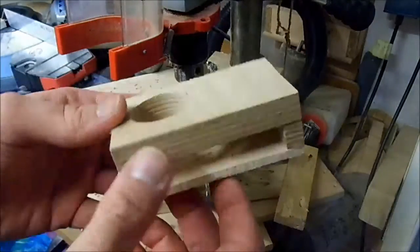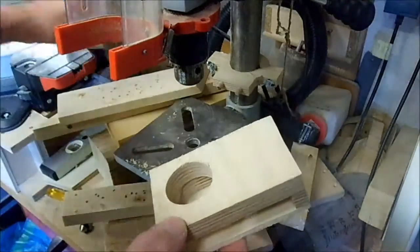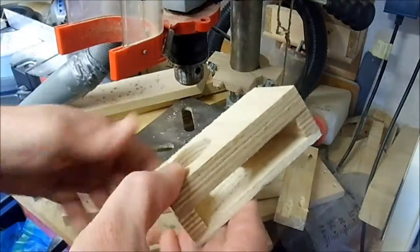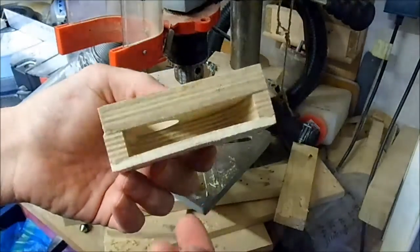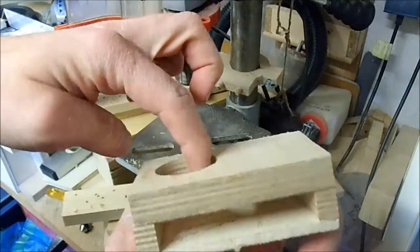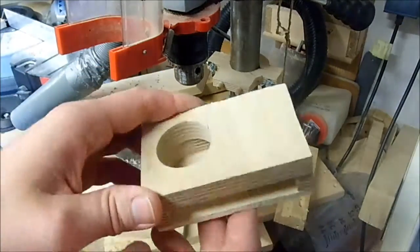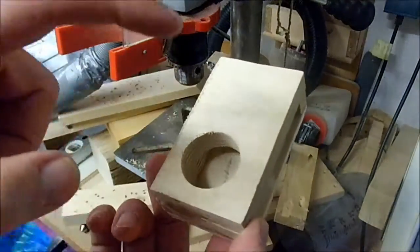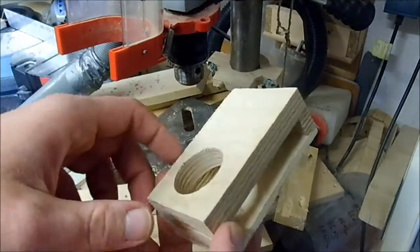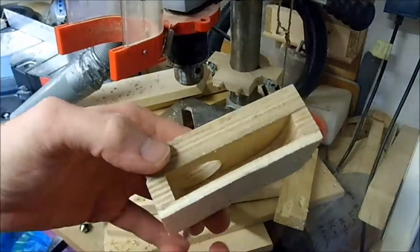It consists of this rather simple piece with a hole in the top layer for the shop vac hose and a transformation shape from this rectangle here to this circle there. I just drew it on there. First I drilled this hole, put it on the other piece and marked this radius, and from there I just drew these lines and cut them out with a bandsaw.